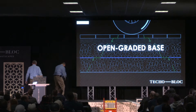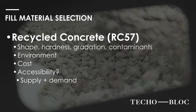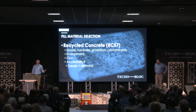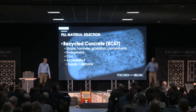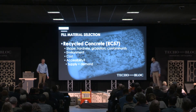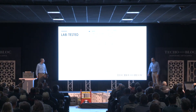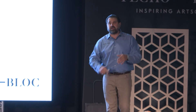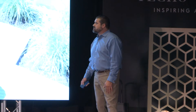Whenever you're using recycled concrete, make sure you check the shape, hardness, and gradation. If there are contaminants like wood, get them out. Brick and tile, we're not worried about. The homeowner was concerned about the environment, so using recycled material was a selling feature. The cost is one-third as expensive — if we can save them money and save the environment, we're in. We got this material from Lehigh Valley, but if you don't have it locally, ask somebody who crushes concrete. And trust but verify — we independently lab tested the material and had them sign off on it. Otherwise, we will not use it.